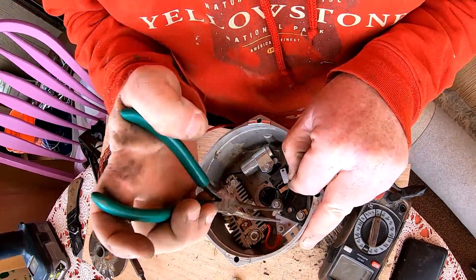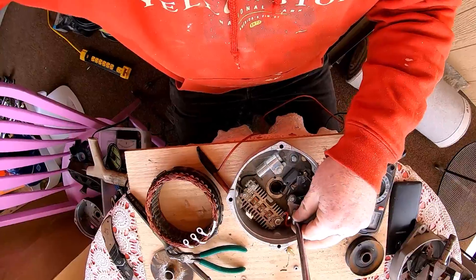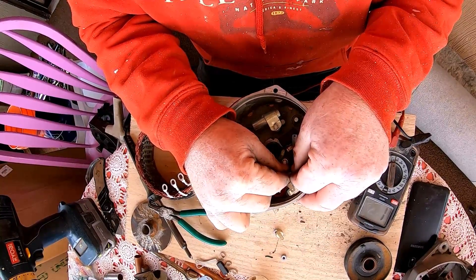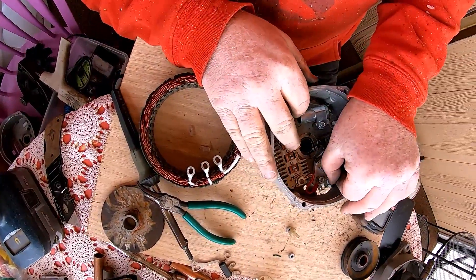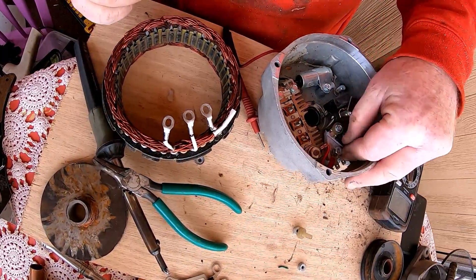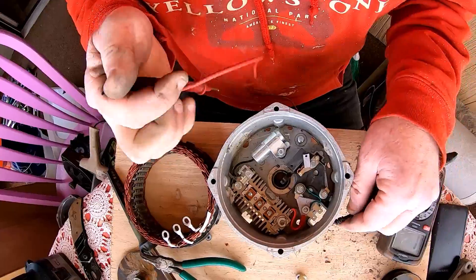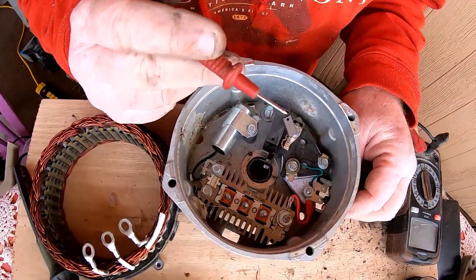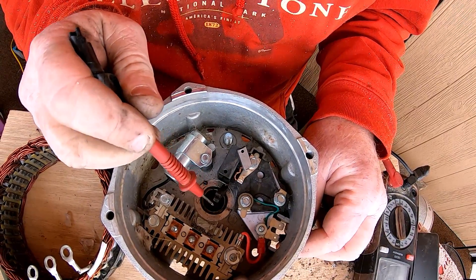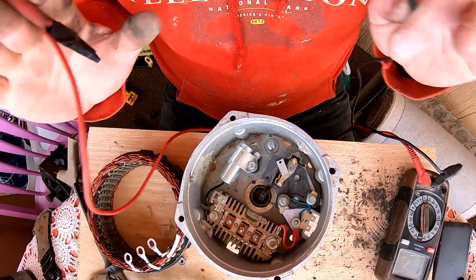Putting this back in. Now, if you're going to put the bare wire on the terminal, always do it clockwise, or at least in the direction it tightens - that way as the nut tightens the wire becomes tighter. We should be able to put that one back there, and then put this one on the ground. There it is - that's all we need.